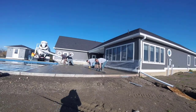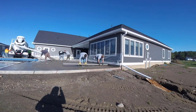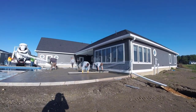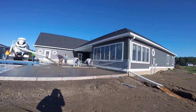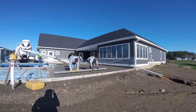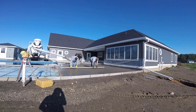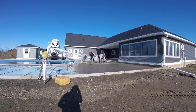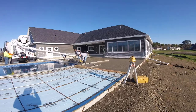The water runs into that deck drain and then runs to the outside. We're striking our wet pad and wet screeding two bays. I've got a five-man crew here today — a lot of times there's just three of us, but I've got a couple extra guys helping on this one. Look at those two bays straight edged.